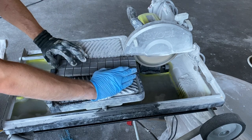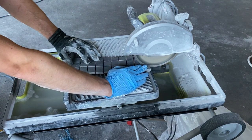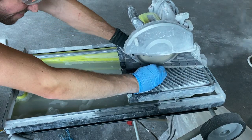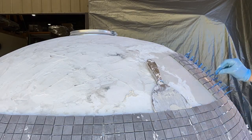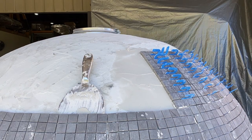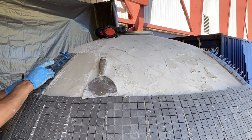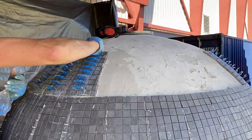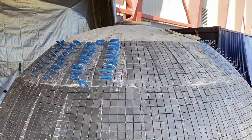As I work my way up this oven, the curvature changes more drastically the higher you get, and therefore the angle of your tile has to become more drastic. Think about it this way: the first row was a full sheet, the second row was a full sheet with an angle, the third row was five full strips with an angle, the fourth is three full strips with a more drastic angle — and what's going to happen at the very top? Even more drastic.